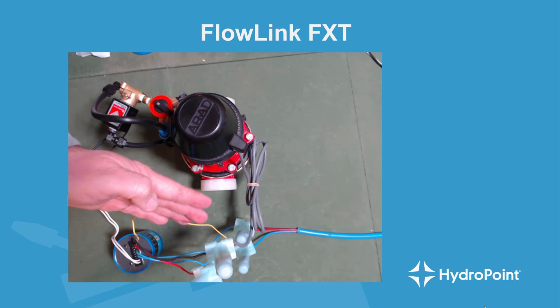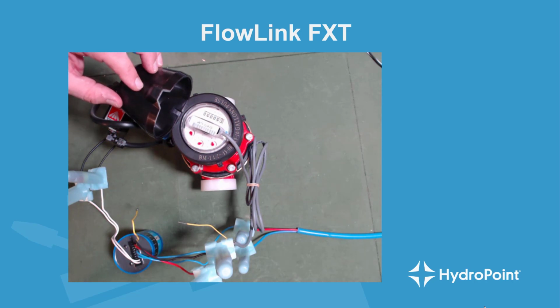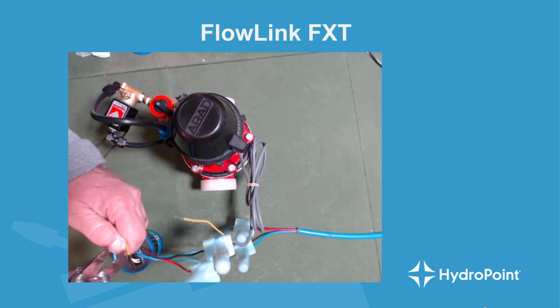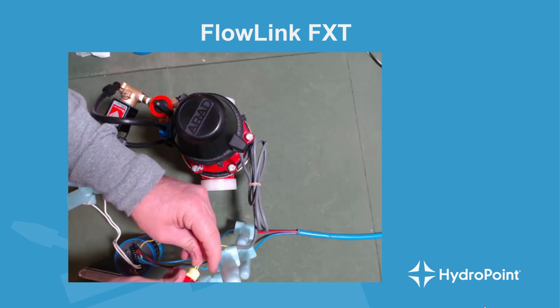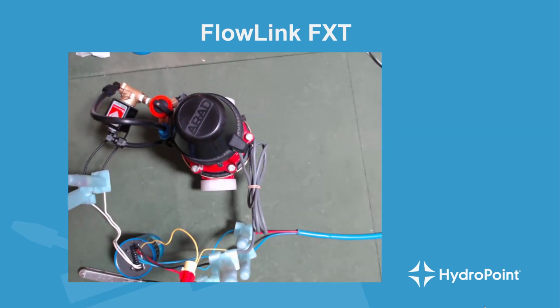The yellow wire for the photodiode actually powers up the photocell that reads the flow sensor and delivers the flow information, and we need to power up that photocell to get it to read properly. For this, we'll need to strip the protective cover off of the yellow wire on the FXT, connect the two yellow wires, and protect them in a DBRY.